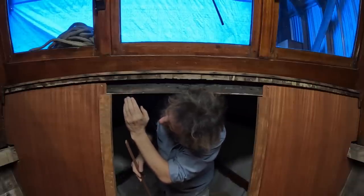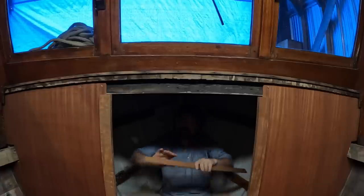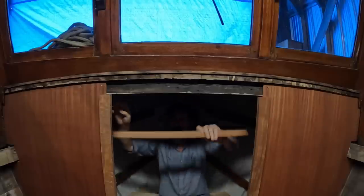I'm going to take this nice thin little piece of quarter inch sapele mahogany and I'm going to laminate it to the top of the beam here, or the bottom of the beam, and that'll create a bit of a frame. It'll actually solve a bit of a problem up here where I transition between this piece of, well, you'll see it in a minute anyway, and it'll tidy all that up and look really quite nice, I think, by the time it's all done. I just now have to rescribe and recut the tops of the posts, door post, door jamb, frame, I don't know what we're calling these,